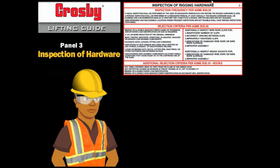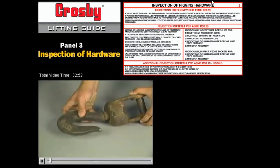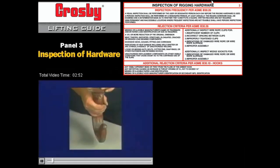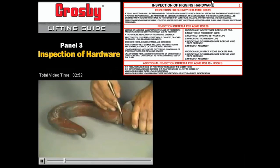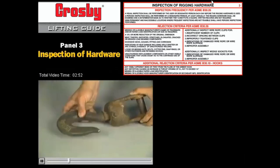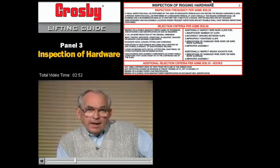Contact Crosby Engineering to evaluate any cracks. Visual inspection of swivel fittings should include shoulder running clearance, lateral movement, wear, and deformation. It's important to remember there is no substitute for regular visual inspection in the field as the first step in a good maintenance program. The shoulder running clearance between the swivel case and the shoulder is generally set at 1/32nd to 1/16th of an inch at the factory. Clearances greater than 1/8th to 3/16ths of an inch, or excessive lateral movement, may indicate dangerous looseness or wear of the assembly, and disassembly with further inspection is required.